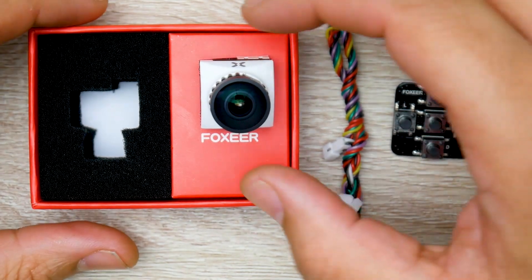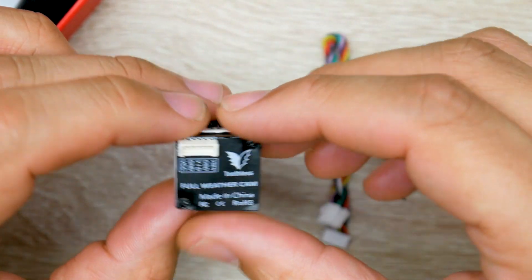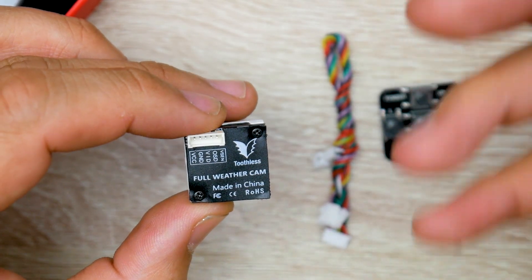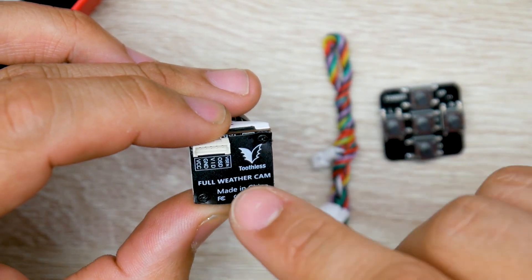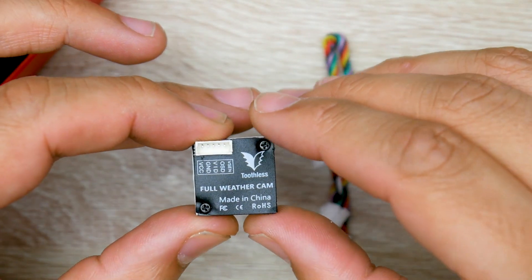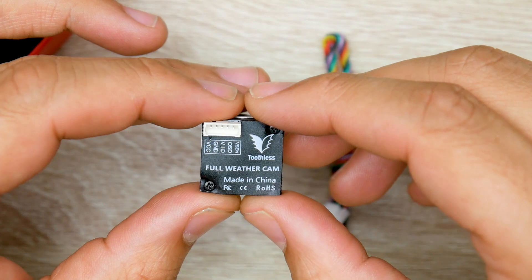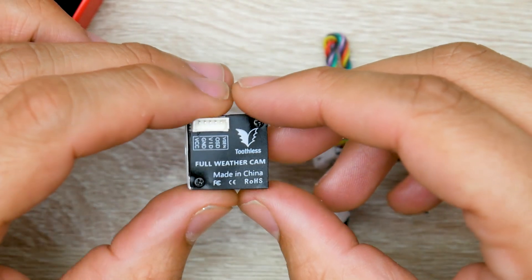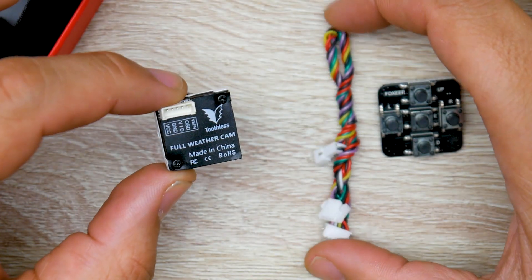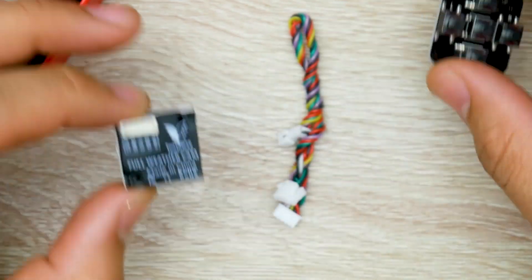The testing results for the Foxeer Toothless are in, and it is honestly what I expected — an increase in latency. Let's take a quick look at the back side before getting into the numbers. This thing can take battery voltage as mentioned, but I don't recommend that unless you really have to. We also have our video input wire, our OSD wire, and our voltage sense wire. The last wire on the right goes to the positive side of your battery, acting basically as a multimeter to display battery voltage on the built-in OSD. It also has an on-timer that starts when you plug in the battery. Included accessories are silicone wires, which are pretty flexible, and the OSD remote with its connector.